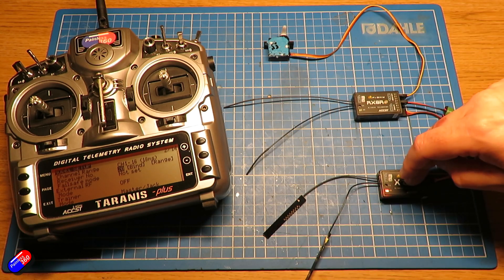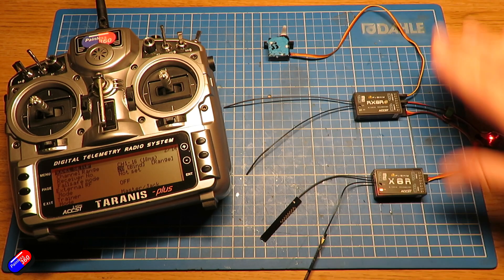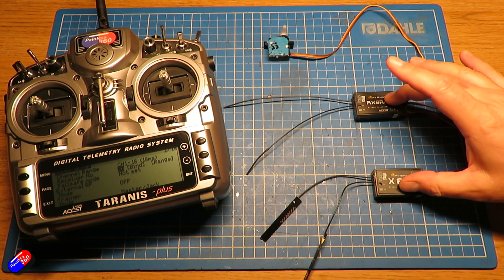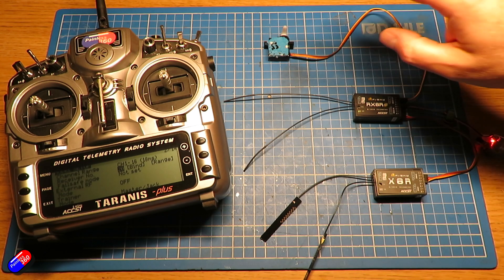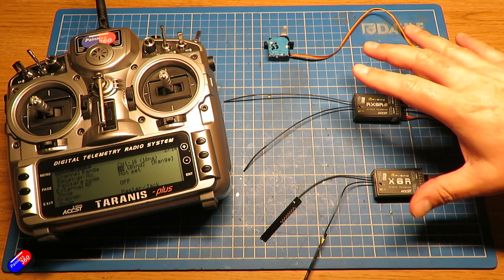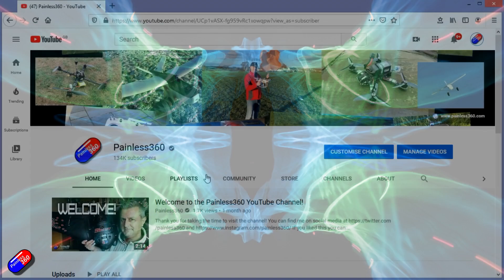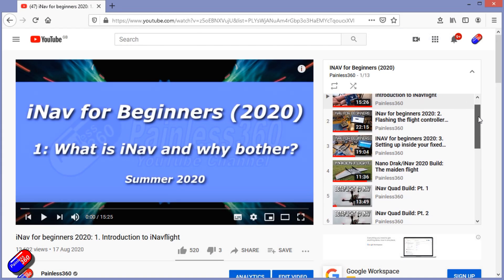The way you do it in practice is have both receivers bound with the same receiver number so that failover happens automatically all the time. Hopefully that explains the issue you're seeing. The key wrinkle is that the secondary receiver has to come up and have a connection first in order for all the redundancy to work. So: bind your primary redundant receiver with telemetry on, using the receiver number you'll use for flying, then bind the second one with telemetry off but the same receiver number, so they're both connected simultaneously and everything works. Hopefully that helps. Thank you for watching - check out the playlists if you're trying to learn a topic, they'll take you from basics right through to advanced stuff.